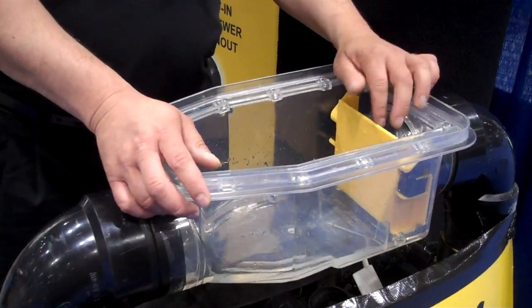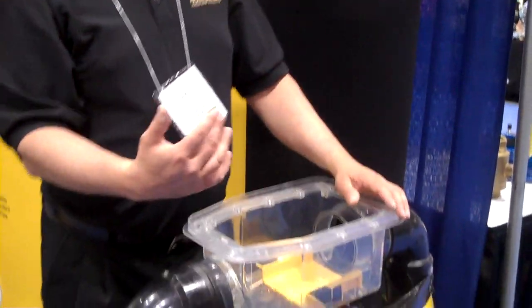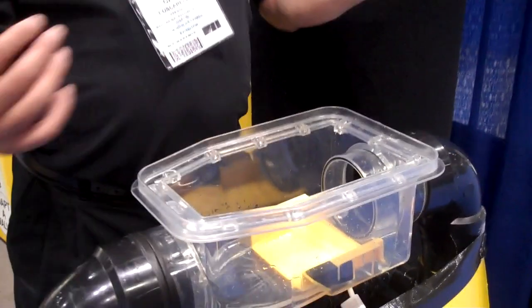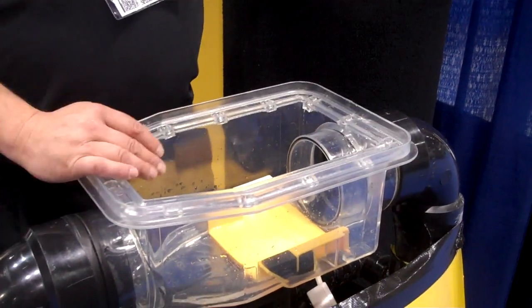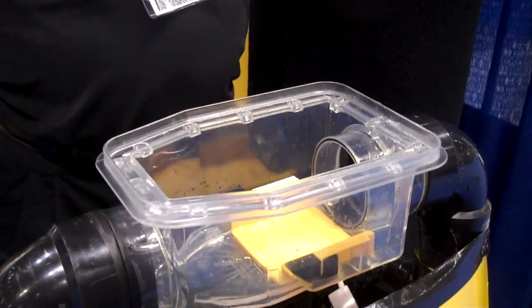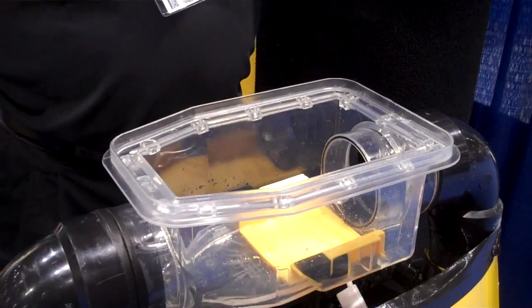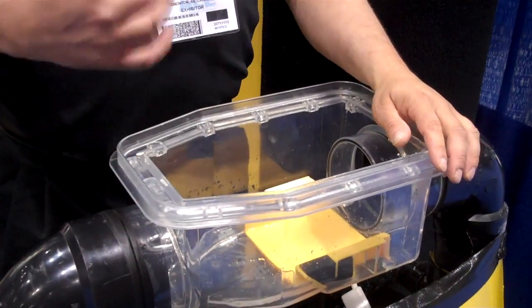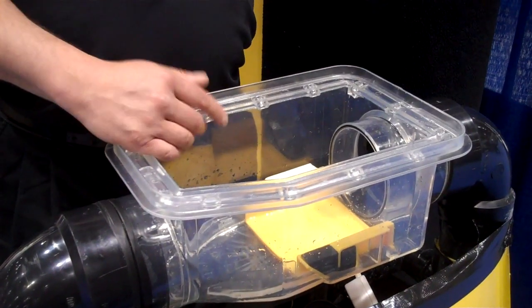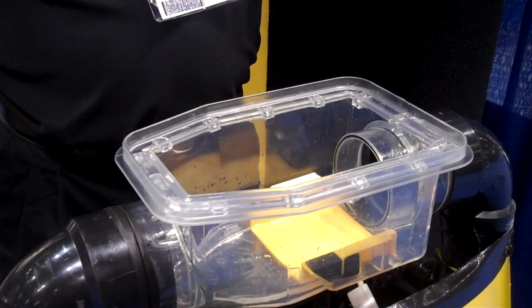This is something that's very popular in Canada. The reason why it's popular in Canada — we haven't done much with it in the US — is that in Canada, we need airflow to our city sewers. We have a city sewer in the street and a venting system up on the building, and air goes back and forth between the city sewer and up through the roof and back down. Because this valve is normally open, we don't affect any air circulation from building to city sewer.